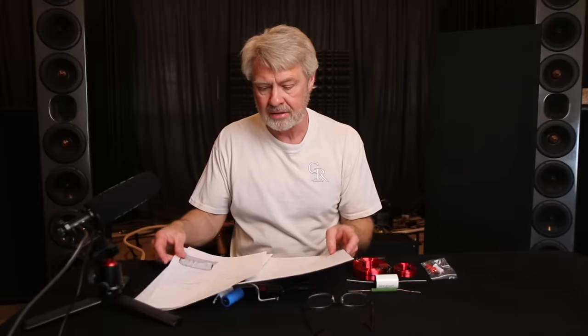Now let's see what I was able to do with this thing. Let's look at the new frequency response compared to the old at one meter — you can see it's definitely a lot smoother. At one meter it's going to be a little louder on the mid-bass panel than the tweeter panel, which is why you see it tilted up. As you move further into the room, that actually flattens out. Looking at 63 inches away, it's flattened out quite a bit and it's really smooth.